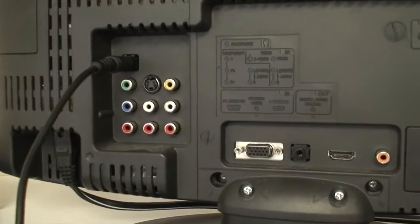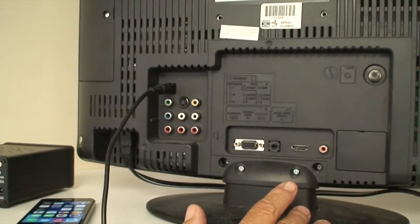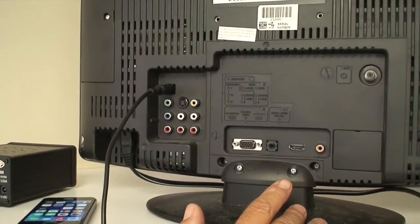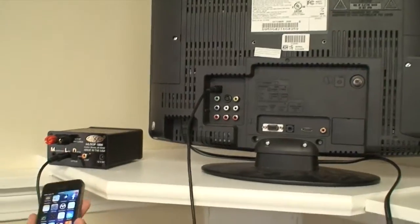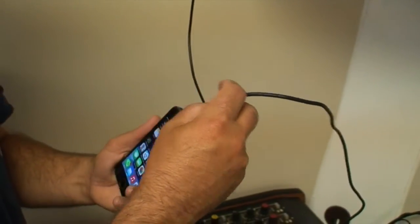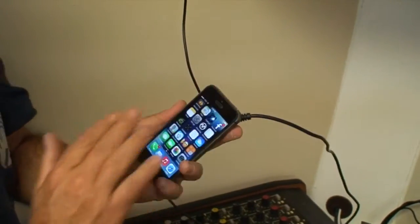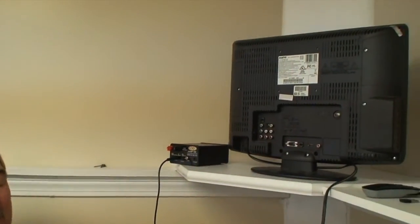When using an output source from a television — be it a headphone jack or sometimes even the digital outs — it's possible that may turn off the internal speakers, or we may not have a good output signal. One way to verify is to take our MP3 player or telephone, use our 1/8-inch cable, connect it to the headphone jack in our phone, and play music. At that point, we can verify that our loop is good and we'll have a strong output. If we know the loop is right but the output is incorrect, we need to go back to our source — in this case, the television — and verify we're getting a signal out.